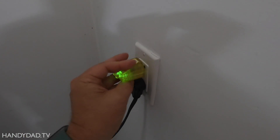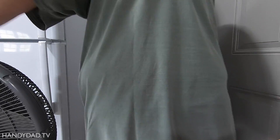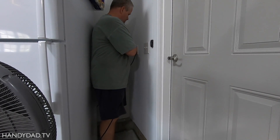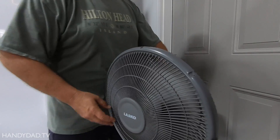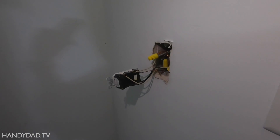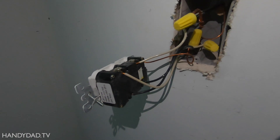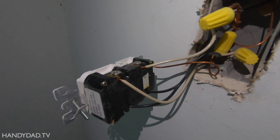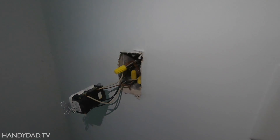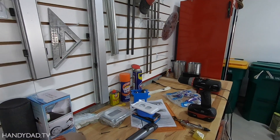The first thing I'm going to do is determine which breaker this is. That little light is great, but in order to work by myself, I just need to plug in a fan and that'll help me figure it out. That's the one right here. Now, I pulled out this GFI — the power is off, and I can see that there's power coming into it and out of it. So this GFI is protecting another outlet downstream, and most likely it is the one on the other side over there, because that one is dead too, so my workbench here is dead.